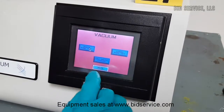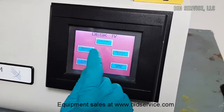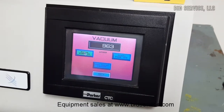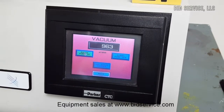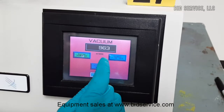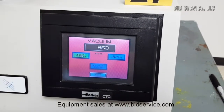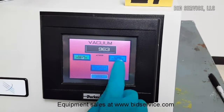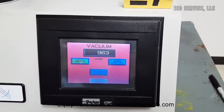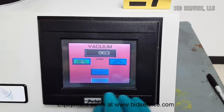On the vacuum screen, this is the main screen where you can select vacuum and start the vacuum pump. After about 2 minutes the vacuum level indicated should be below 150 mT. At that point you turn on the turbo pump and the chamber will pump down further, below 10 mT.